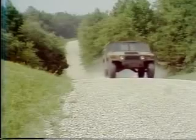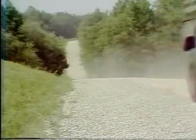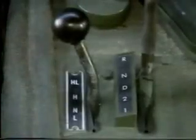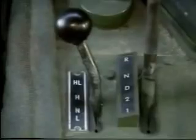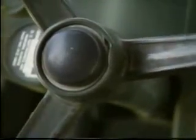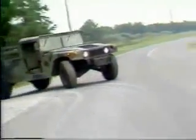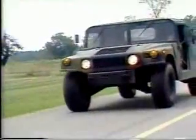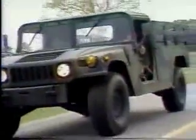While driving this vehicle, there are several during operation checks that must be made. Observe the instrument panel and watch for any unusual readings. The transmission and transfer case must be observed for any strange noises, vibration, or unusual operation of the shift levers. Be alert for any wandering, unusual vibration, pulling, or binding in the steering mechanism. Be especially alert for any brake fading or pulling of the service brakes and sticking or binding of the brake pedal. Pay attention to any unusual noises, smells, or vibrations in the driveline components.